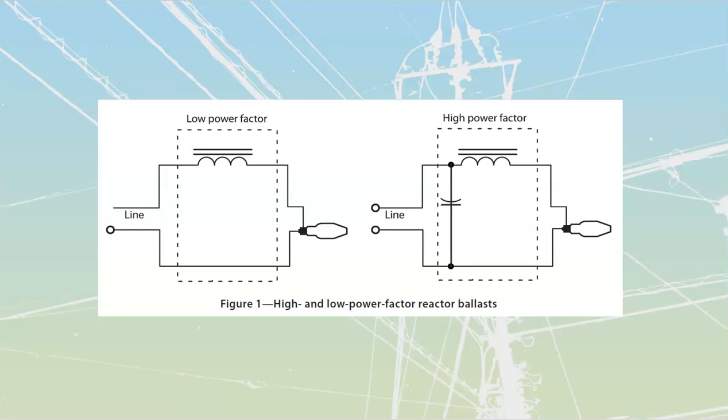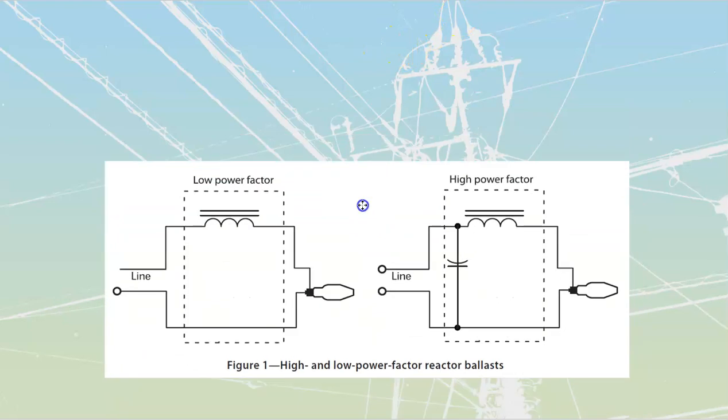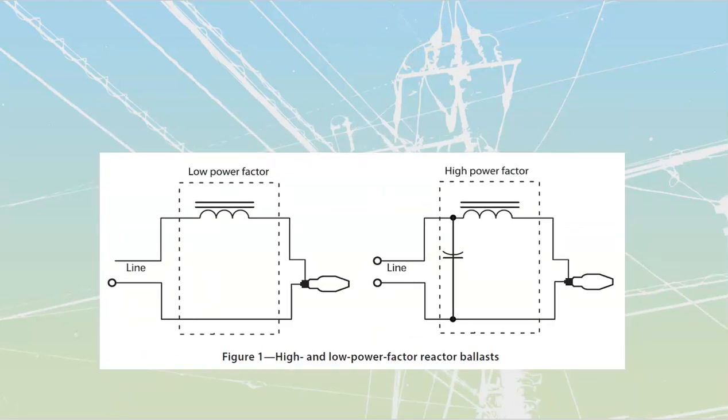Particularly where this becomes an area of concern is inside of dusty types of areas. If you have any sort of experience working around a lot of my... I'm just going to move that one down there so I can draw one in here. But what we refer to as our low bay and our high bay types of fixtures, they're oftentimes going to have a can that's hanging down. And then right above there, there's going to be a big aluminum box. The reason that it's aluminum is, A, for lightness in a lot of cases, but also because aluminum is a really great heat sink. And then your ballast is bolted inside of that.